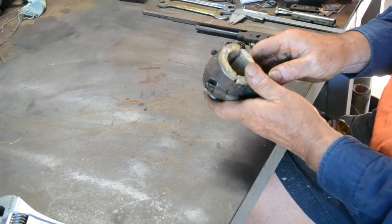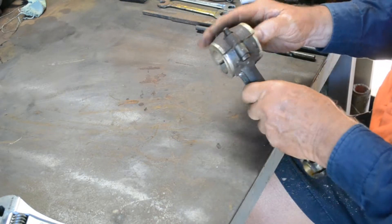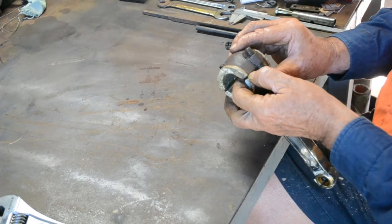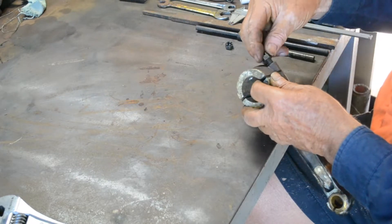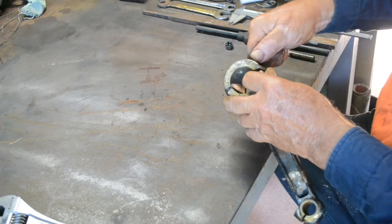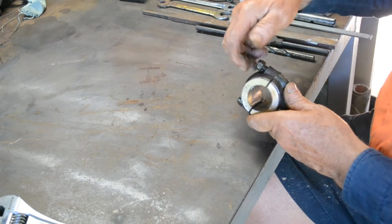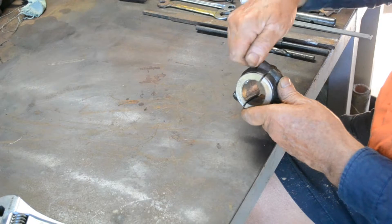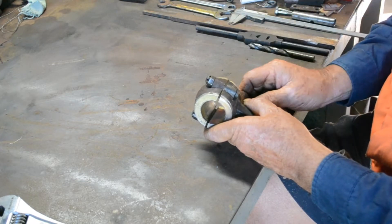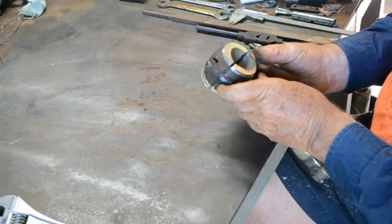I've got the right shell there. Usually these bottom and top frames are marked — this one's four. Put your nuts on there. You may have to clean the threads up; you should have them nice and free. If they're tight, just get a die nut and run over them or a tap and run through it. You don't want to be fighting them all the way because eventually you're going to have to put some tension on that bolt. Just make sure the shims are right, evenly spaced there.